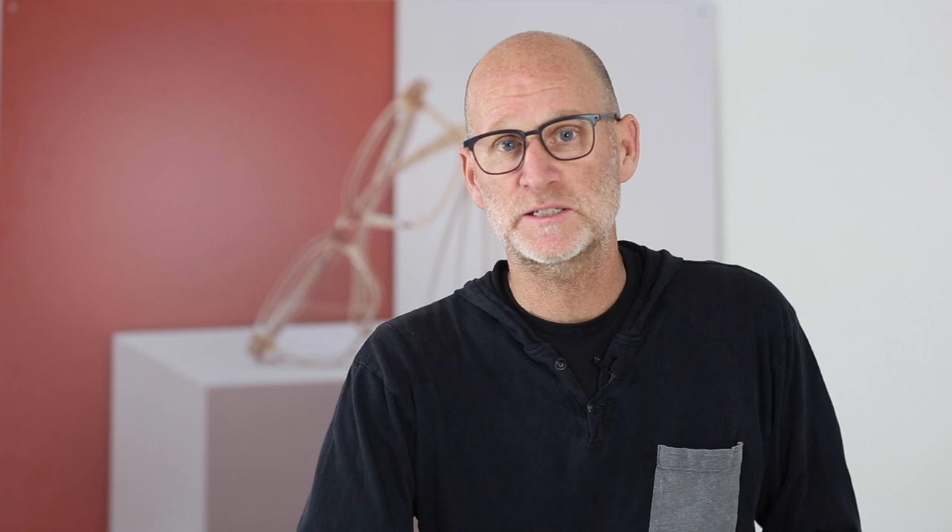After milling the front shape, the fronts are loaded into a tumbling machine. Through a process of tumbling, similar to a drying machine with various chips, this removes the hard edges and surfaces of the acetate material. The next step is to add the face curve or the bending to the front of the frame. This is done through a process of pressing the eye shape and eye curvature into the frame.